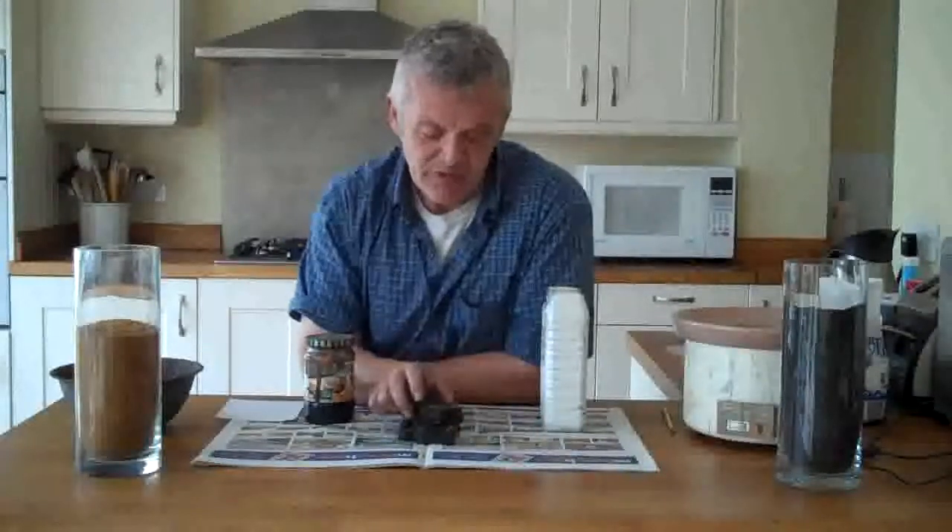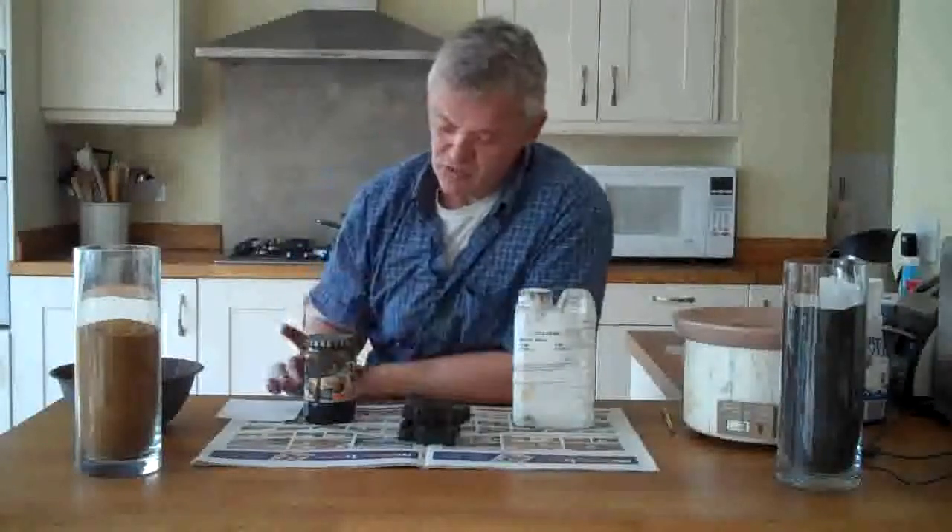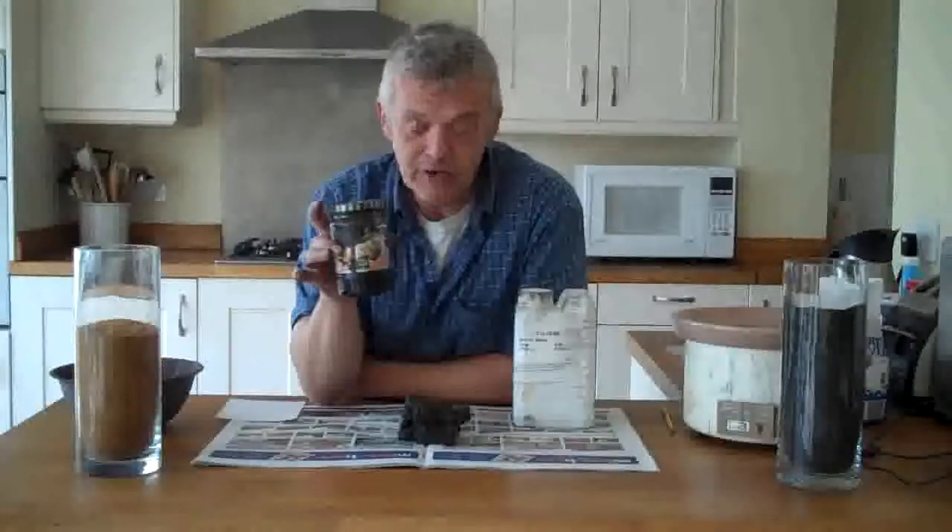The carbon you're going to coat it with is asphaltene or bitumen — it's pretty much the same stuff. The way to get that is with some toluene, which will dissolve it, and a source of your bitumen. This is actually just a bit of pavement from road works nearby. I put it into a jam jar with some toluene and shook it until the bitumen dissolved off, leaving all the rocks and sand in the bottom. I poured off the toluene and bitumen mix into a jar and collected it that way.